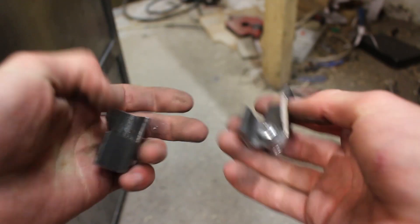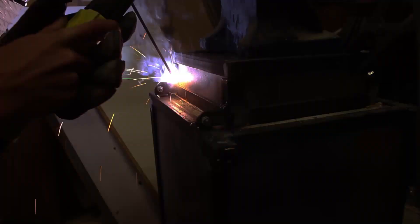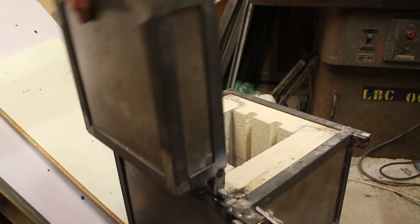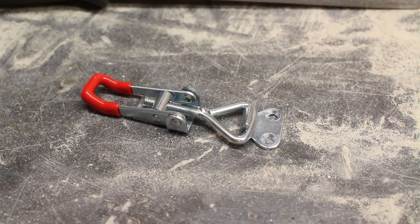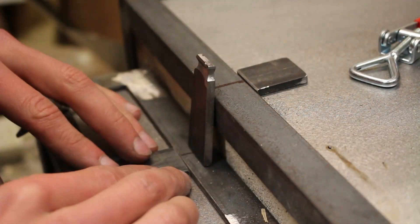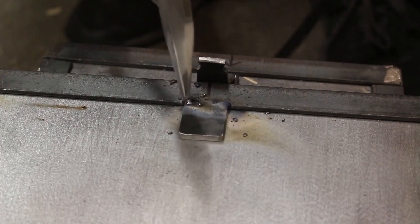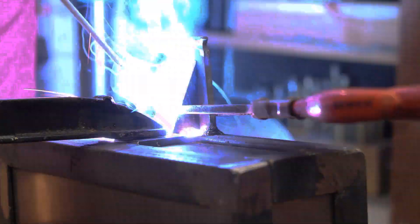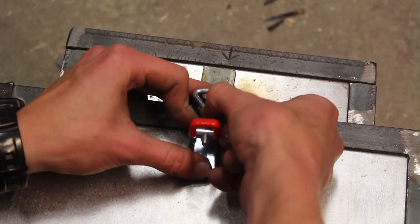A bit of filing and grinding later and I've got a working hinge that I can then weld into place. The door can hinge like this once I've got everything tack welded in place. I bought this simple door latch which is what I'm going to use to keep the door shut. I could have made one of these but it was literally £1 off eBay. The latch is going to attach on like this with these pieces of steel that I've just cut out and I've got lots of pieces for reinforcement so it should be pretty strong. This is how the latch is going to attach onto the frame and the door, and I'm going to tack weld it on with my welder later on.